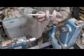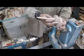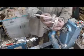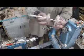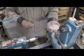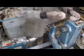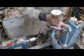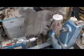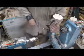Now we just got to drill a hole, and we'll drill the hole into this piece here deep enough so that this will ride just slightly proud of the base. And so for the 3/8 hole, it looks like there'll be lots of material in here. So I'm going to go to the drill press. I've got a jig on my drill press where I have a hole that I can lay this in. I support it, and we use this hole here as the guide, and then the drill press makes the hole nice and straight. I'll come back after I'm done at the drill press.